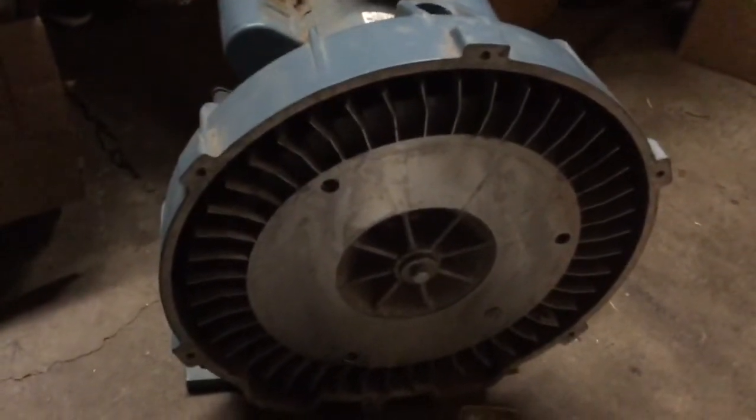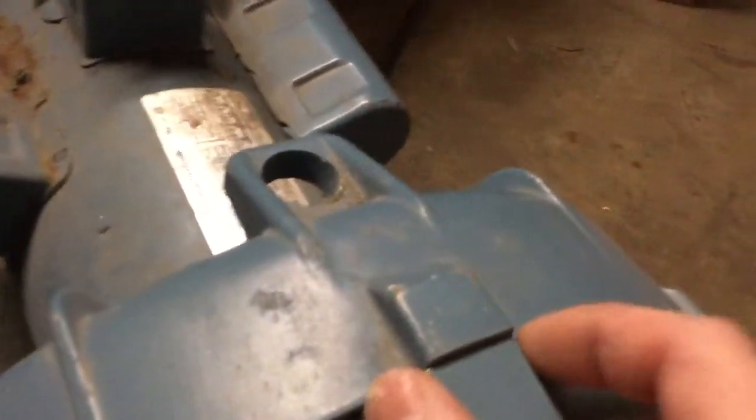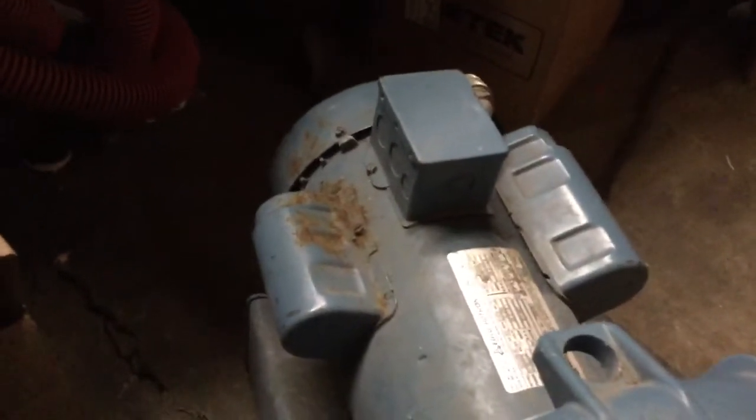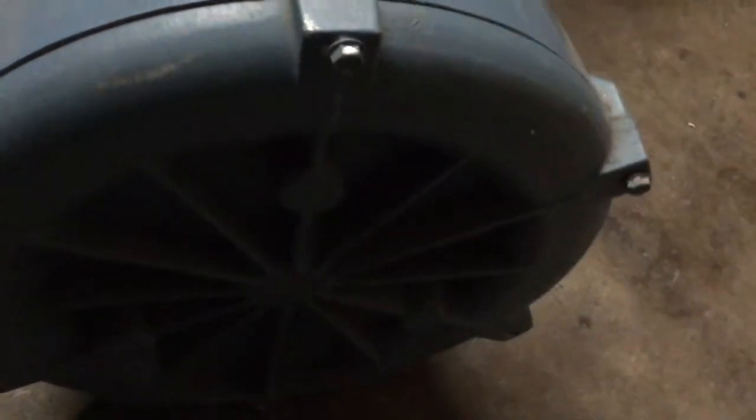You can use it for blowing or for suction — I'll be using it as part of a vacuum system. Let me put this back together. This particular one is powered by a three horsepower single-phase induction motor. You can tell it's single phase immediately because it has capacitors on it. If you look at the nameplate, it's actually made by a division of Ametek called Rotron — it says EG&G Rotron, but today you buy it as an Ametek Rotron blower motor made by Emerson. You can wire this motor just like the single-phase Spencer machines — for 115 or 230 volts, with half the amperage at 230.